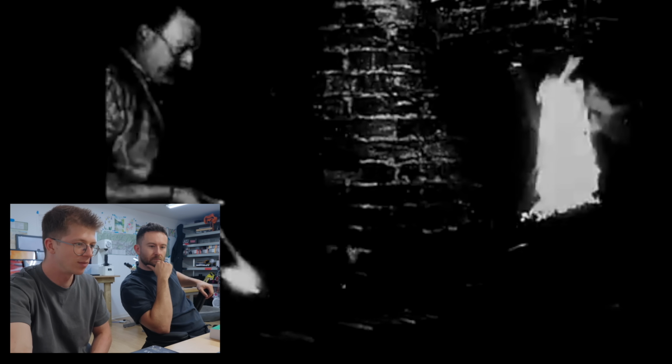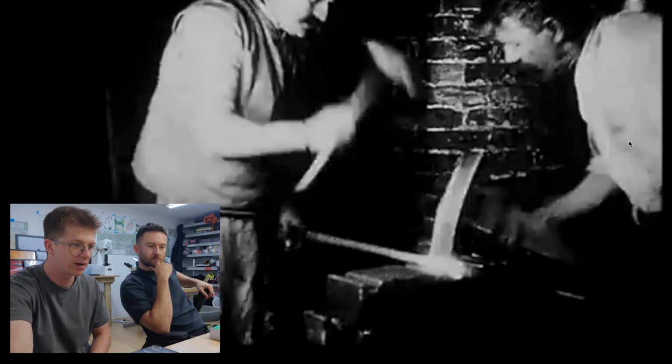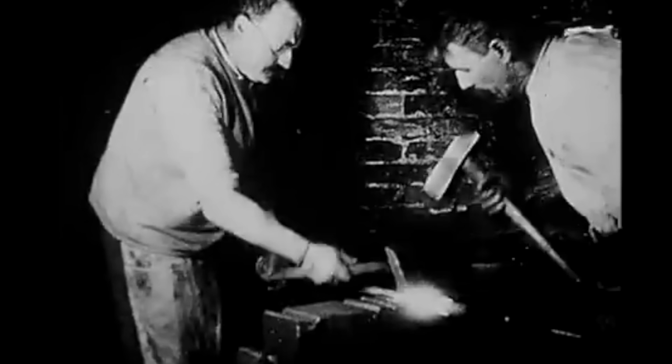Now look at all the different sizes of swage that they have in that anvil. So this is either a different workshop or a different anvil. There's gotta be 1, 2, 3, 4, 5, 6, 7, 8 different swage diameters here for as they're working the barrel. So we're gonna have our work cut out. Boom, out the fire, a sparkling heat. Mandrel got thrown in by the helper super quick, and they're just spinning it around while they weld. So he bumps it against the inside face of the anvil to get it welded.